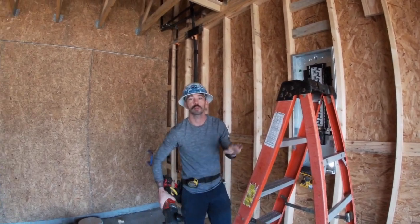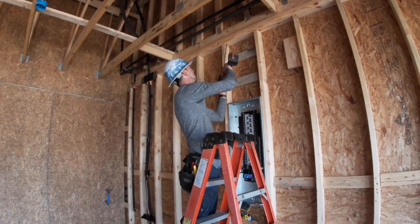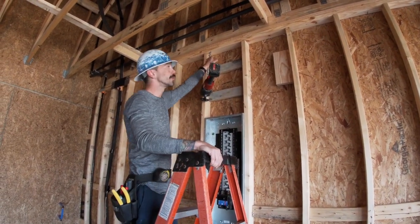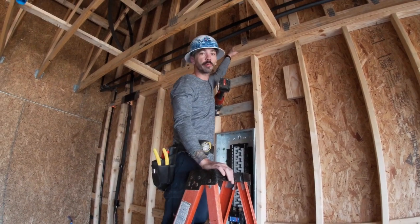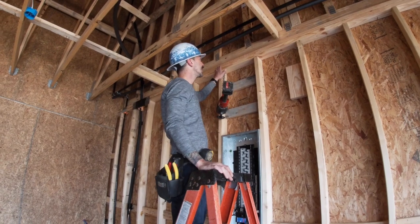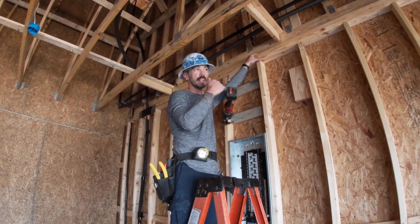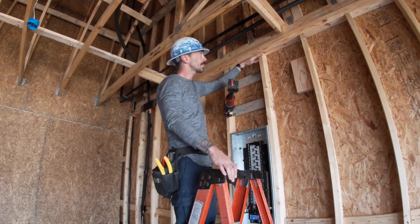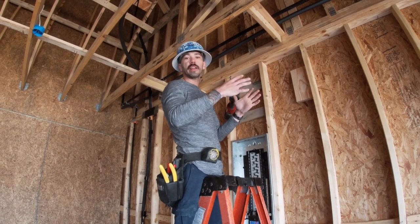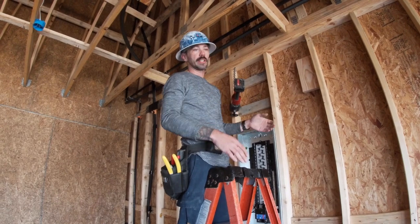Okay, before we put our Romex connectors in, this is the perfect time to go ahead and drill out the panel. And you can see that I'm drilling really shallow because this is a prefabricated truss right here, and you don't want to drill through that, so you can keep this as shallow as possible anyways, because we're going to go in here with a 16-inch or 18-inch nail guard, and it's going to protect all the wires, and it's also going to use to mend the 2x4s that we're busting up by putting so many holes in it.